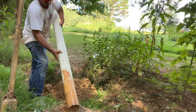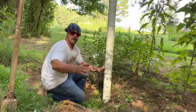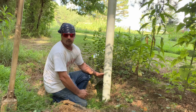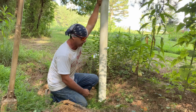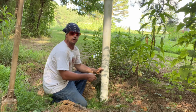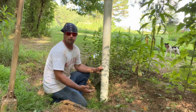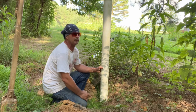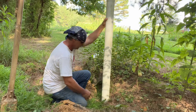This thin wall pipe is actually sucking up and pulling some mud out by working a little bit. Now I would not suggest you go and start trying to hand drill a well just anywhere like this. I'm one of them guys that I just keep experimenting around with whatever I got laying around till I find something that works. This thin wall pipe is light enough that I can handle it. If I get this one piece all the way down in the ground, I'll be three or four foot past my water. I'm going to pour pea gravel around the outside and the inside. But before I do that, I'm probably going to pull it up and drill some holes around the bottom up about a foot. The water level is probably going to fluctuate some, and it may fluctuate a lot.